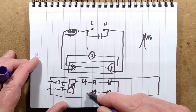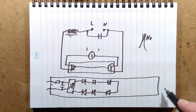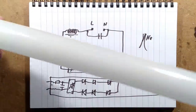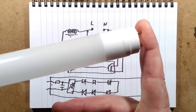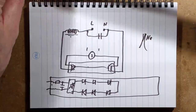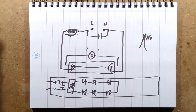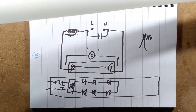Some very early LED tubes got rid of the starter and just linked the pins at both ends — live at one end, neutral at the other. That was phased out quickly because maintenance workers were putting one end in the holder, fumbling around the other end, and getting their fingers across the live pins. If holding metalwork, there was a high risk of electric shock because the tube passes current even if it hasn't struck. Even with traditional fluorescent tubes, an electrostatic discharge could make the tube strike and deliver a shock.